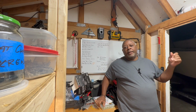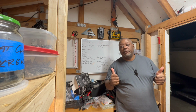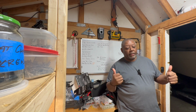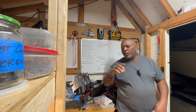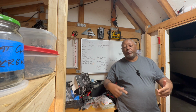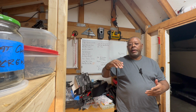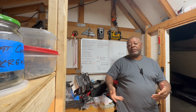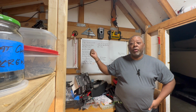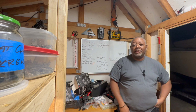Okay, everybody. I got the batteries installed in the boat, the new ones, and they look good. I ran the engine for about an hour or so. Everything looked good there. The water that comes out the side is an indication that your water pump is pumping water through the engine. The water did get warm, which means my thermostat opened up and cycled through its paces. So everything was looking good there. That's just one more item I can check off the boat list.